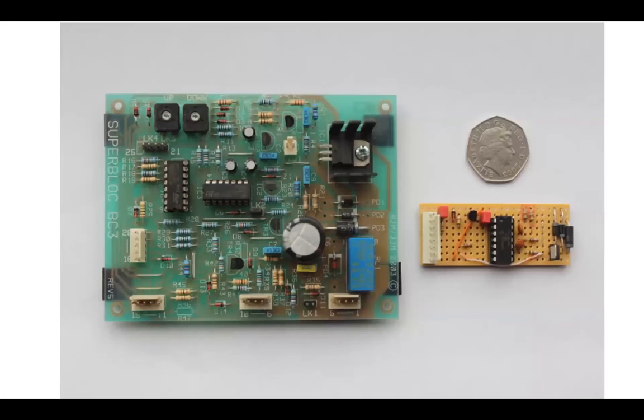A picture of the SuperBlock — its other name is BC3, meaning Block Controller 3. It's quite a large board with lots of components on it because it is a controller in its own right — a DC controller. So when I had 22 of these on my layout, there were 22 DC controllers on the layout. On the other hand, this is my implementation of Julian Coles' circuit. It has much fewer components, it's a much smaller thing, much easier to deal with, and also cheaper.